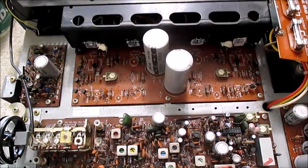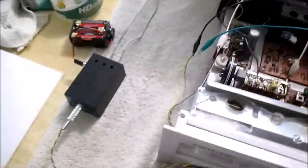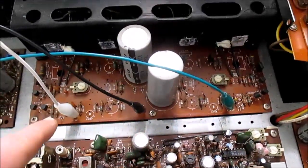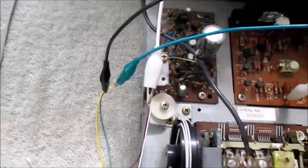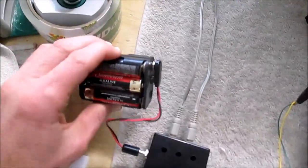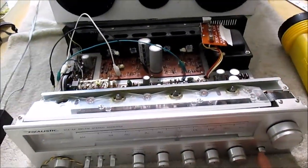Let's get this thing hooked up and see what happens. I've hooked up this amplifier. After telling you all about the protection circuit, I did not use that — I just took my meter and made sure there's no stray voltages on the test point. I just connected it to this little amplifier input, the outputs go to the speaker here, and a little 9-volt battery pack here. Now we can see what goes on with this receiver.